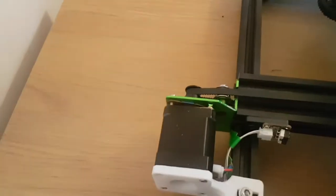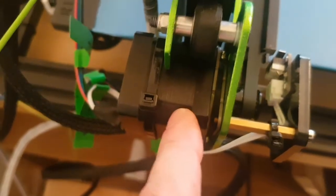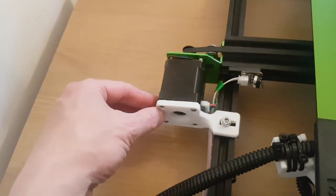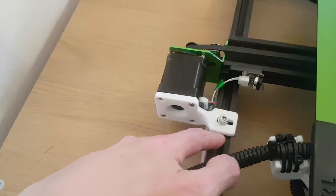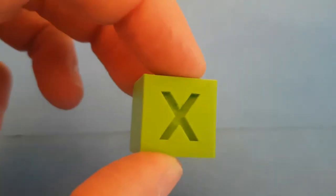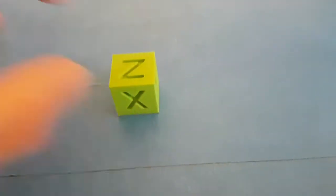I then solidified everything further by putting motor dampers on — two plates with rubber in between that go between the motor and the frame to stop the frame resonating with motor noise. The trade-off is you only get two screws on the motor and two on the frame, and you can't use the wire brace with them. So I printed a TPU flange and TPU washers to take the worst of it out as a compromise. A test cube with the dampers on came out 20x20 perfect — any banding is only on the Z, so they do work.